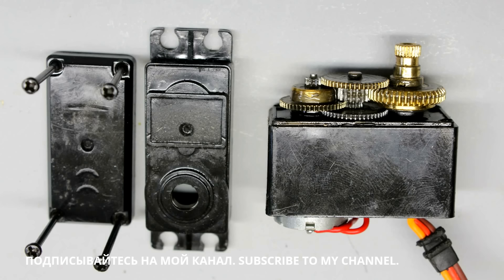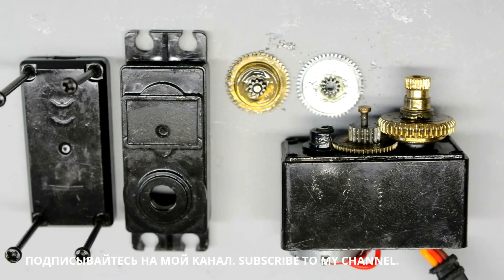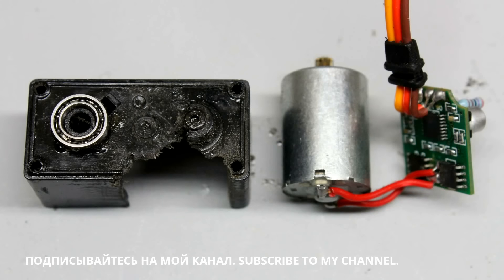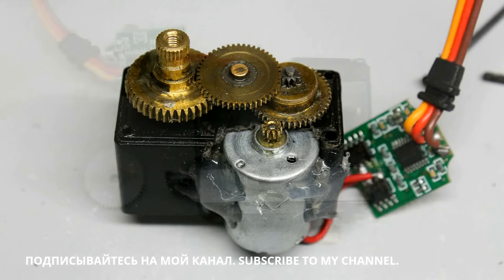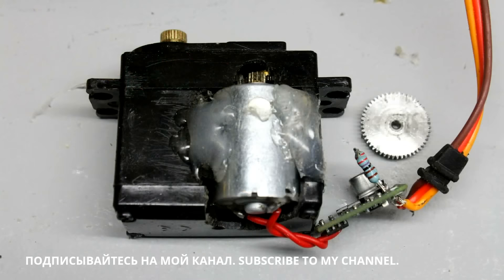Time for a second servo hack — the gear ratio has to be lowered. A simple way is to remove two gear wheels, which reduces the gear ratio from 1 to 260 down to just 1 to 13. However, with that ratio the torque is too low to move the axis. When removing just one of the gear wheels, the motor has to be mounted in a new position. The case of the servo has to be cut to bring the motor close enough to the first gear wheel. I used hot glue, but you can also use some epoxy.